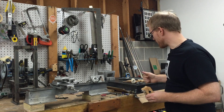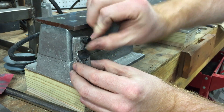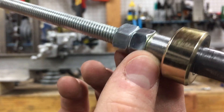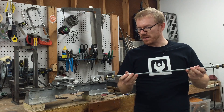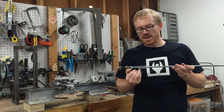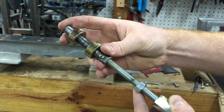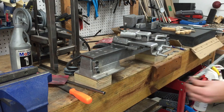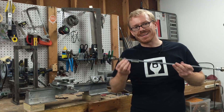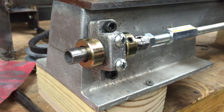Once I had the outer diameter of the tube properly sized, I was able to slip it into the bearings that I had cast. I just epoxied the lead screw into the journal on the end with the crank. On the other end, you need to be able to unscrew the lead screw from the journal to remove the temporary coupling. I ended up welding a nut onto the journal for the headstock end of the lead screw, then used a second nut to tighten up against the journal so it's a solid assembly and I can get the coupling off when I need to.